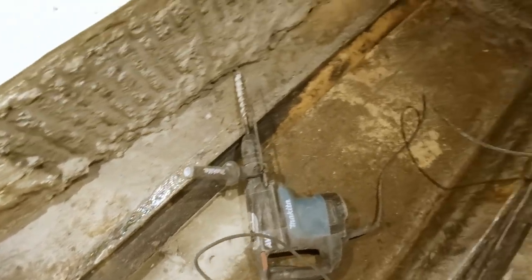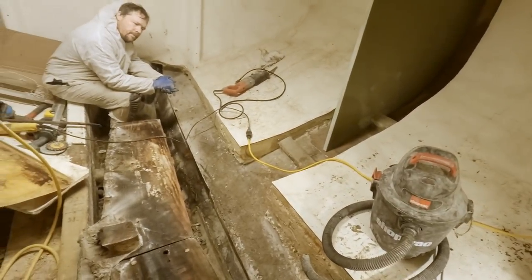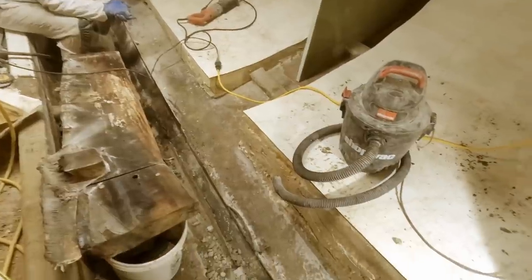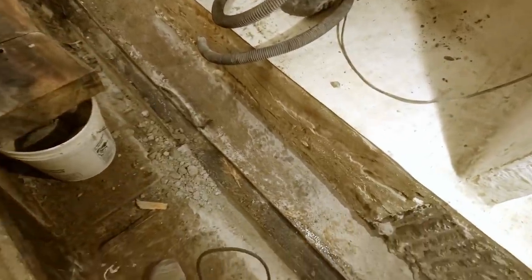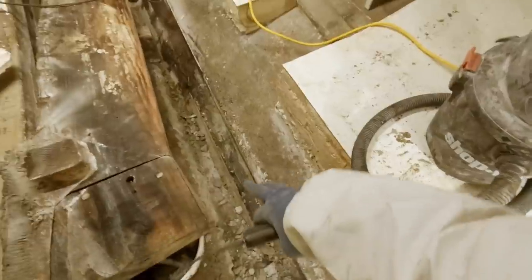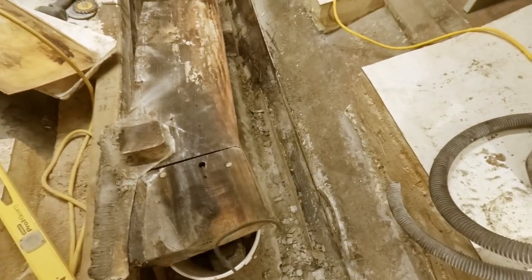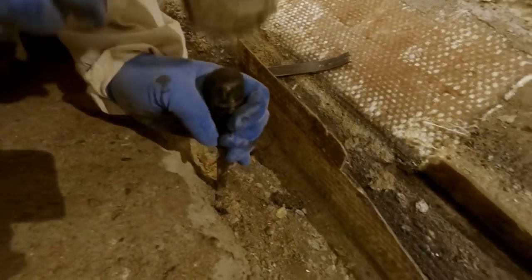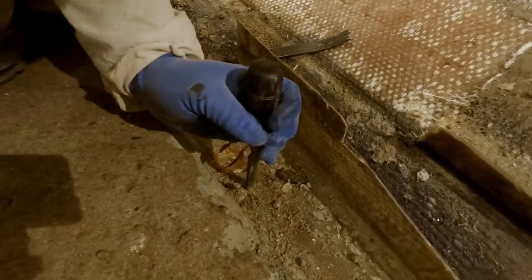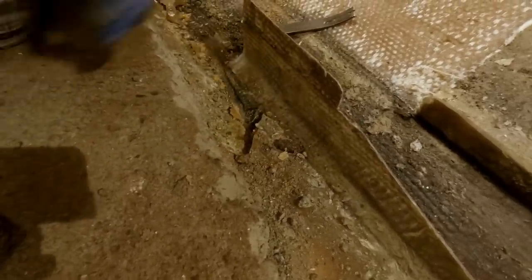It's going good up here. It looks good. Same thing, boring holes, you go all the way forward. The pole up here is a lot less slanted compared to back there. Sure enough, it's leveling off, isn't it? That's kind of weird because it almost looked like it was even more slanted. I thought it was going to be really deep up here, but it's a lot less steep, which is good. What we thought might have been laminate, like a bowl in here before, was just a bunch of resin on the inside of that stringer. No strength in resin. Gotta have glass in it.